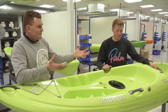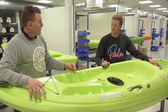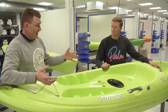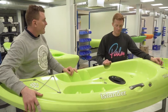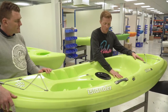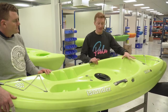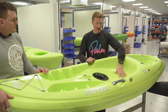Some sit-on-tops tend to literally sit you right on top on quite a platform — our Hula model was exactly like that. Others tend to sit you right down inside, which has the benefit of stability but then you can't really paddle. We were definitely walking a fine balance — we didn't want a wet ride sitting super low, but we wanted the seat to feel like it was encompassing around you without a seat pad, so we have quite a deep seat well.